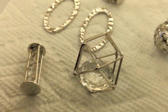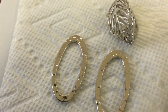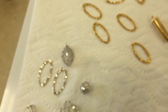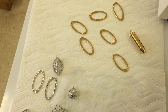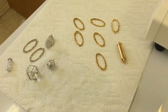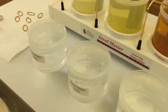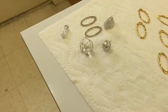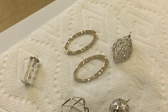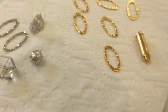That really did brighten things up — that little ball was even brighter, and these flat parts were pretty nice and bright too. Everything looks really good. There it is next to the gold stuff. The rhodium solution is really easy and forgiving, but you just want to make sure the part is freshly gold plated and you won't have to worry about it being clean. There it is, folks — looks similar to silver but you don't get the corrosion.